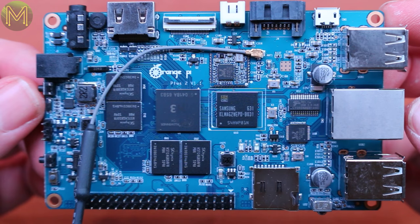So here we have it. Starting from the top right and working clockwise, we have two USB 2.0 ports, gigabit ethernet, another two USB 2.0 ports, infrared, SD slot, almost standard Pi header, upgrade button, recovery button, TTL UART for console, power button, 5V 2A DC power jack, TRRS audio and video out, mic, HDMI, camera interface — not MIPI CSI — SATA power, SATA 2.0, USB OTG. Then there's the Realtek 8189 Wi-Fi, Realtek 8211 Ethernet, 16GB eMMC with pre-installed Android OS, 2GB RAM, and the Allwinner H3.